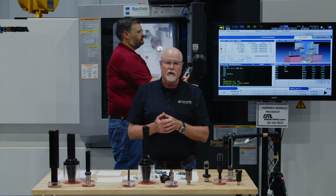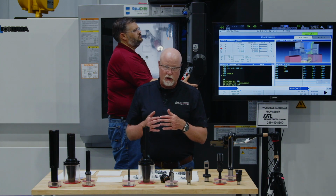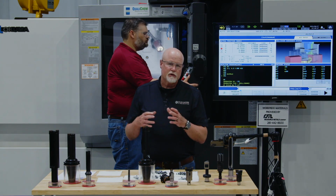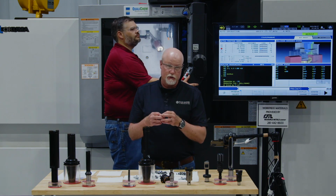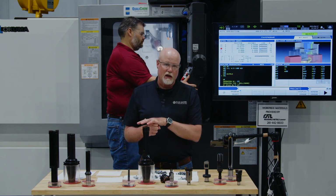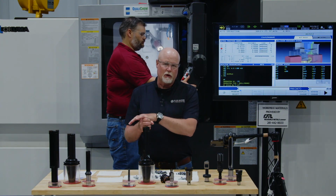Then we're going to come in with a Wohlhaupter 420 series boring head. It's a finish boring head to take it from 1.25" out to 1.299, which is approximately 33 millimeters, and we're going to do 2 of those holes. And then on the last hole, we're going to come in with a burnishing tool set to 33 millimeters and burnish the last hole. So we're going to drill all 3, bore 2 of them and burnish 1.